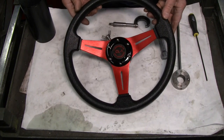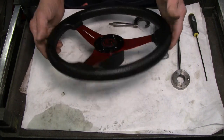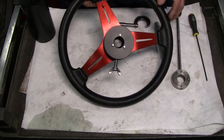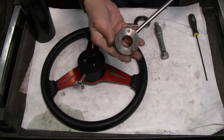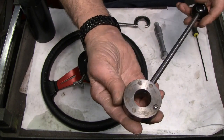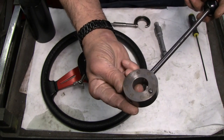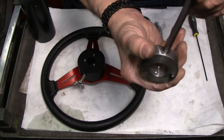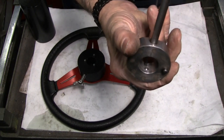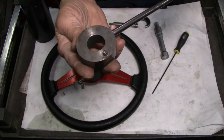Let's go to the roll-around cart and see what we have. Here is the quill wheel as we've seen before. This particular one that Jim sent is the CL1 clone — it has a through hole approximately one inch and two hundred and twenty-five thousandths. For the Burke mill, this is the quill handle feature. There is a nominal one-inch hole — it's actually about a thousand and a half over one inch. It is secured by a spring-loaded ball detent that snaps into a groove on the quill feed shaft.